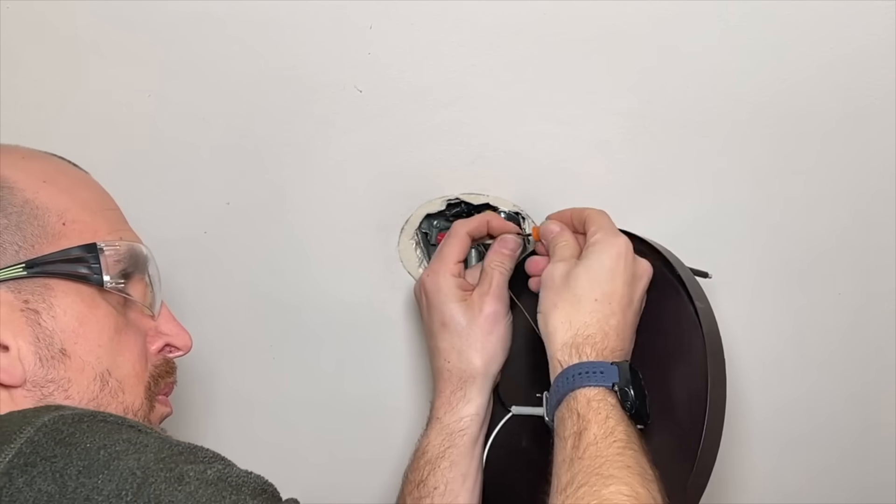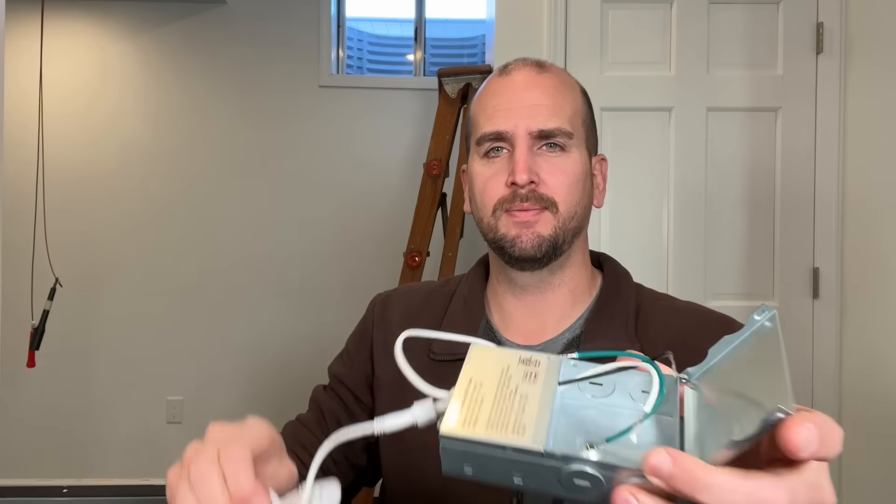The mistake comes from when you need to connect stranded wire to solid core wire. This is extremely common in light fixtures such as vanity lights, ceiling lights — I have one right here which is an LED recessed wafer light — and inside the junction box all your connections are going to be stranded with your neutral, hot, and ground. You will also see this with a lot of the smart switches that are becoming more and more popular. This is so important because a loose connection can equal at minimum additional heat in your junction box, which might lower the life of some of these connections, and at maximum can equal arcing or a short, which can be a fire hazard.